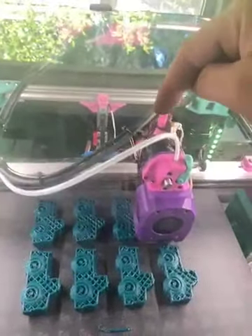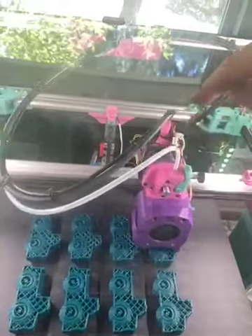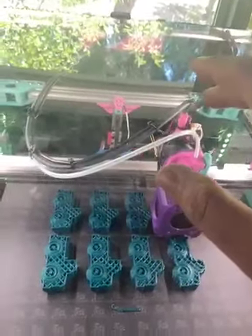The cartographer and the beacon and the EBB36 base should get tied real close to where it comes out. Then just keep going. When you tie in the Bowden tube, it's going to depend on your specific printer. As you saw, this printer likes it tied there — I get good graphs with that. This printer doesn't want it tied together; I get good graphs on this one without it.